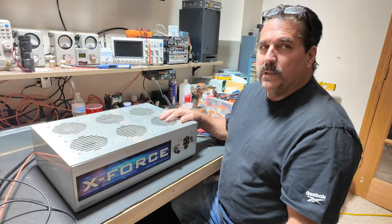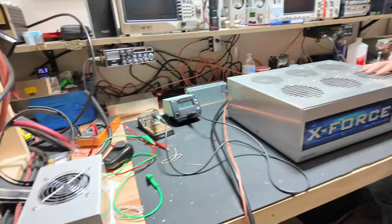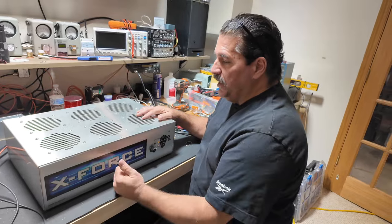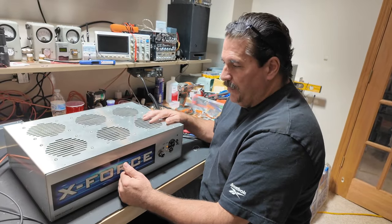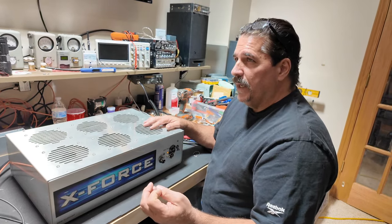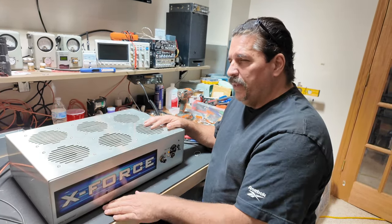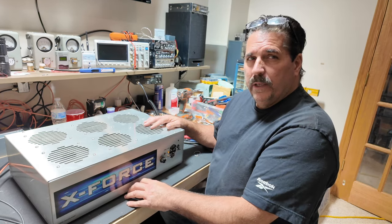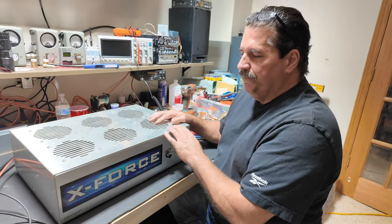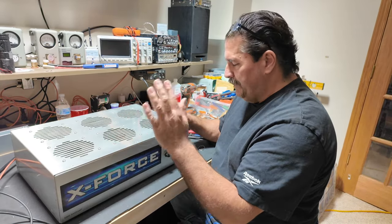Nice. Yeah, it'll do 1,000 watts all day. You know what I mean? If we put that driver into it, wham, it'll do a little 2-pill? It'll do 1,200. So it's working perfectly. I would run it basically like this. You don't really need much more when you're talking on sideband. Right. Why push the box? I think he's going to be running an RCI radio or something like that. Yeah, I think so. I can't remember how many watts he said. 80, I think. Was he running that or was he running a Striker? I can't remember. No, I think he's on RCI. An RCI? Okay. So, I think his radio is doing anywhere from 50 to 80 watts, which is absolutely perfect for this. Talk all day long, 800 to 1,000 watts, bada boom, bada bing.